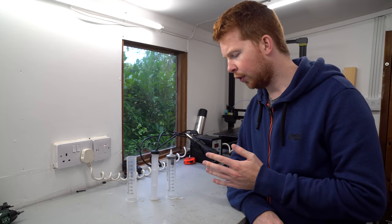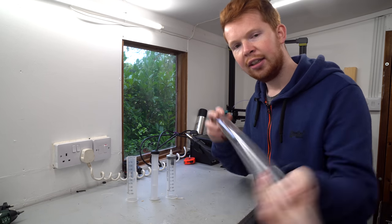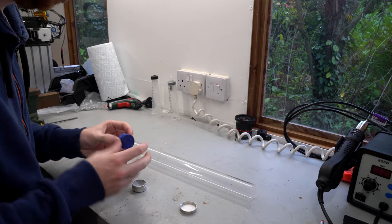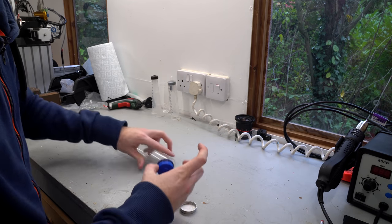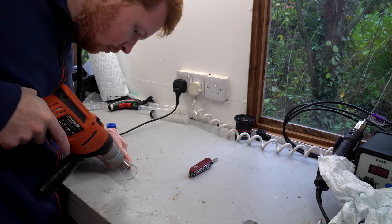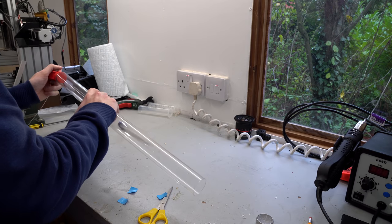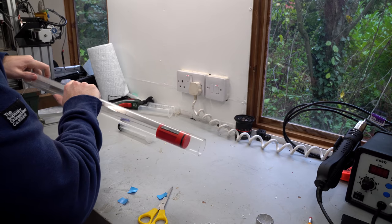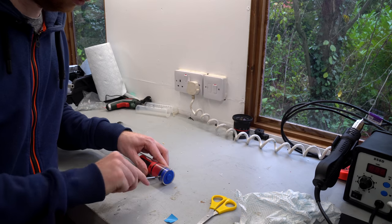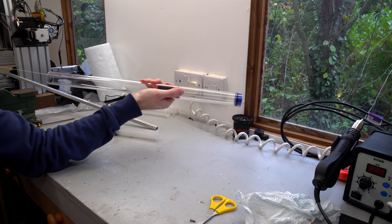I think in order to improve on this syringe rocket we need something slightly larger — something like this. To turn this acrylic tube into a giant syringe, I had to 3D print a bulkhead that will hold an o-ring at one end, secured in position using three bolts threaded through the acrylic tube. The piston was a dense 3D printed part with mounting space for lead tyre weight in case it wasn't heavy enough. Once the top bulkhead was bolted in position, the piston can be pulled back to create a vacuum, giving us a 560 millilitre syringe — or nearly one pint.